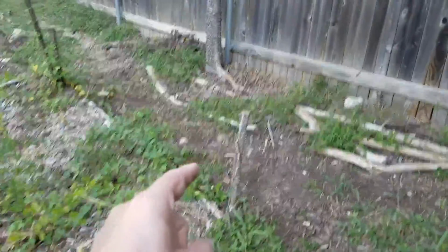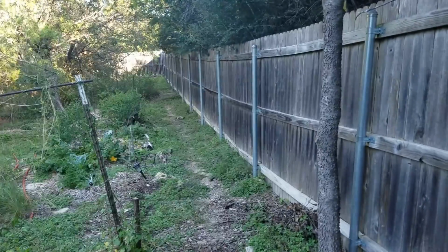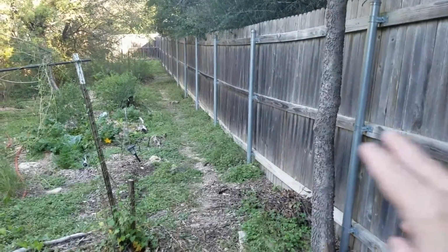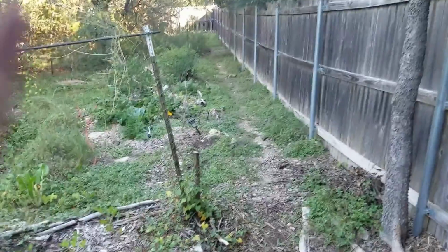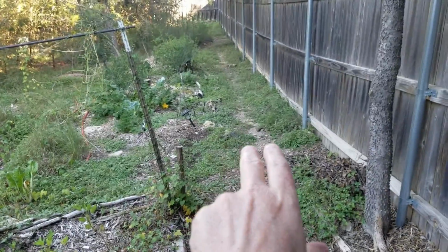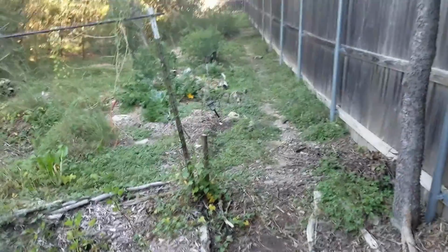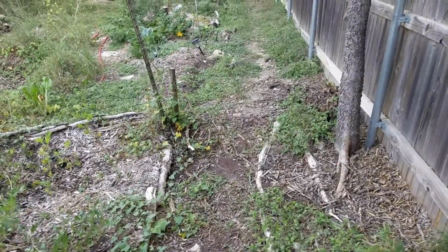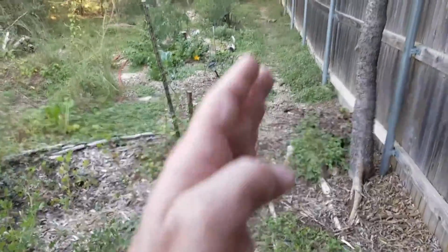And you probably can't see it, but there's actually a trench dug all the way down the front. This side I own. If you saw one of my previous walk-in talks, I showed you a little preview. It's a 100 foot by 100 foot space this direction, and it's actually uphill, so it's already flowing this way and stopping at these trenches that I've dug, these swales, mini swales. So in rain, we'll have water puddle up here for several days, soaking into these garden beds. And then what I'll do is build the drain for this creek so that the first time we get enough water volume, it's the first drain to start draining, and it will drain down the front of these garden beds.